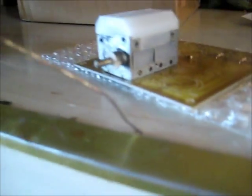This is an antique style tuning gang with a plastic cover on top, which is a good thing. It's got a little reduction drive. If you want to buy one of these kits and you're a beginner like me — the last time I built a kit was when I was in year 8 — start with the small components first, like resistors. I'm a bit rusty with resistors, so I do that to get some practice and place them in the right spots. In this case R3 was not used on this model. Then move on to the capacitors and the little switch — all those components.